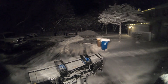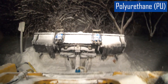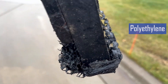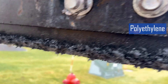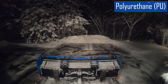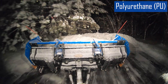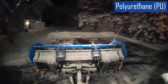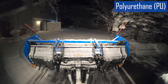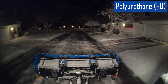And then there's temperature sensitivity. Polyurethane tends to perform better in extreme cold because it doesn't become brittle at low temperatures. Polyethylene becomes increasingly more brittle as temperatures drop, leaving it prone to cracking at very low temperatures, especially with repeated heavy impacts. Polyurethane can handle a wide range of plowing conditions, from light snow to heavier snowfalls and ice, and excels in situations involving mixed snow and ice and frequent freeze-thaw cycles where scraping hard compacted snow is required.